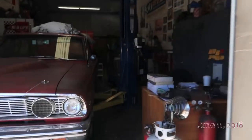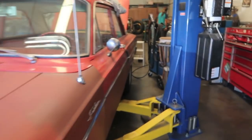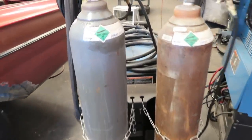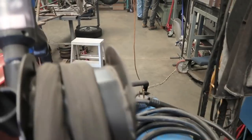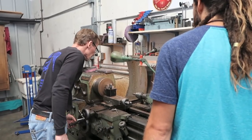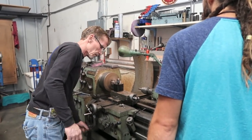We're back in Rolf's shop, finalizing our pintles, cleaning up the welds on the keel and rudder brackets, drilling for zerk fittings, and welding the very first gudgeon. Step 1, decide if we have enough slop or margin of error on the part of the pintle that moves within the gudgeon.